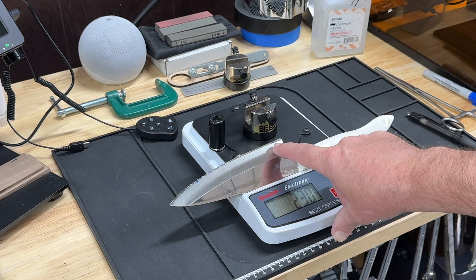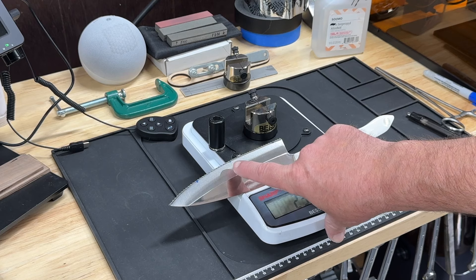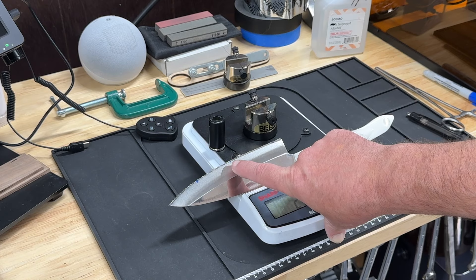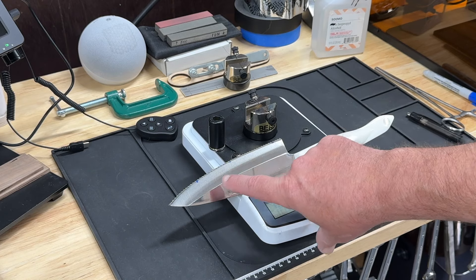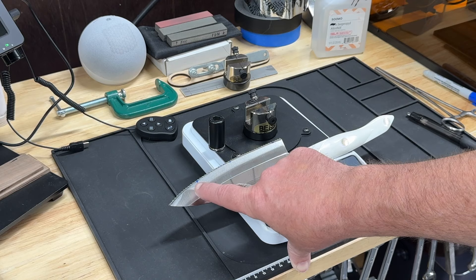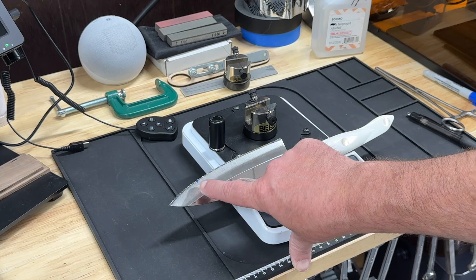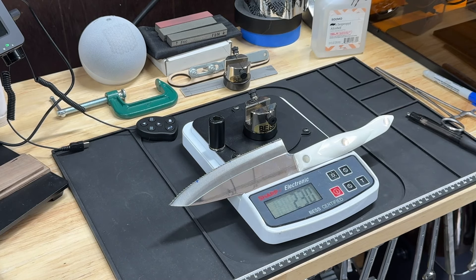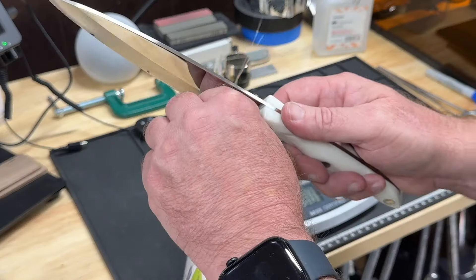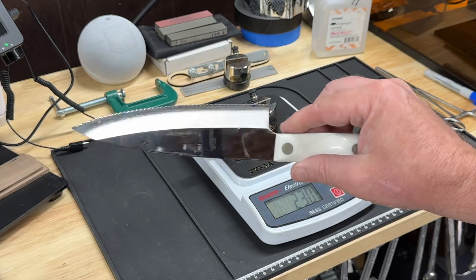Final results: the very last part of the knife we started at 421 and ended up at 230 — excellent improvement. The middle of the knife we started at 249 and got it all the way down to 190 — also an excellent improvement. On the front we went from 483 to 289 — a very good improvement, though not quite as great as the back two. We could work on the front more if we wanted to, but the knife is cutting really well and the teeth have come back to it.